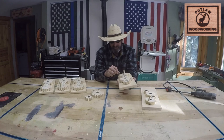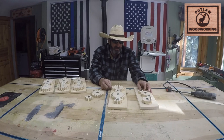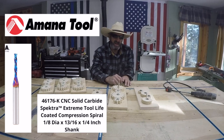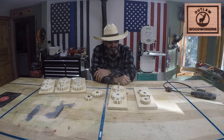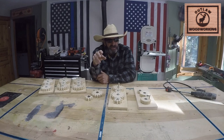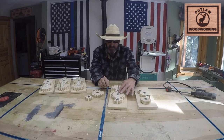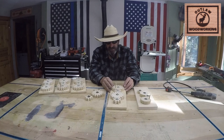Let me show you on the CNC cutting it out. I'm using an eighth-inch spiral bit by Spectra — I think it's a 461-76; I'll put a picture of it here. What I realized was it was going really fast, a little too fast. You can see on this one it knocked out a little piece there. This is just pine, so it's soft material — you should slow that speed down. It was running at about 120 inches per minute, and I reduced it in half. The RPMs stayed the same; I just made it go slower so it took its time, and it came out really well.